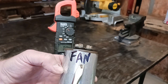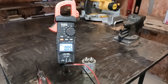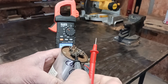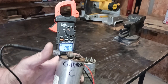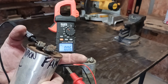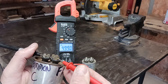The next thing is I grab my terminals. It doesn't matter which terminal you use — either the red or the black. First, stick a lead inside of the common terminal. Notice how you don't see any readings yet. Now here is the FAN lead — I'm going to stick a terminal right in here. Make sure it's good, and notice how it says 4.990.